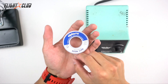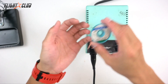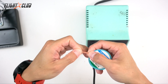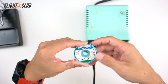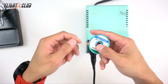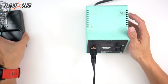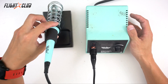That flux stuff gets pretty messy and nasty. You might also need some soldering wick. Wick is basically like a sponge that sucks up solder. It's handy when you make a mistake — you can use it to suck up the solder and redo your soldering joint. That's basically the basic equipment you need for soldering. Next I'll show you the basic techniques.